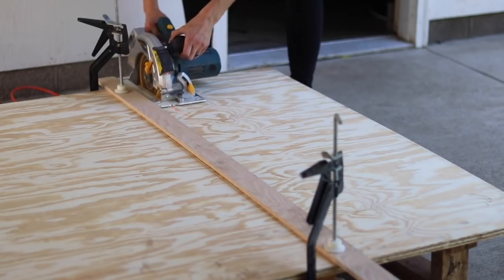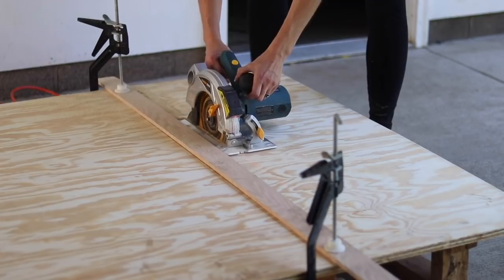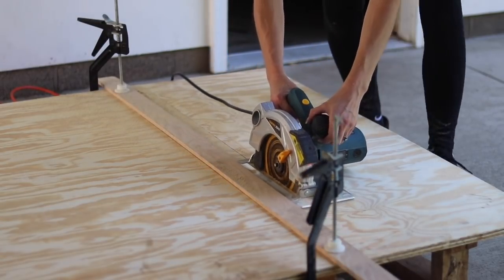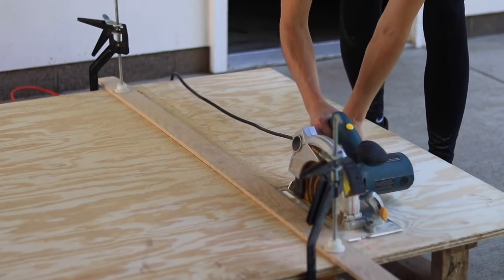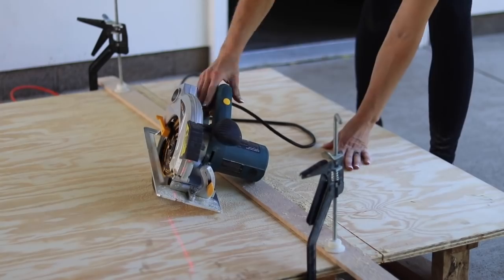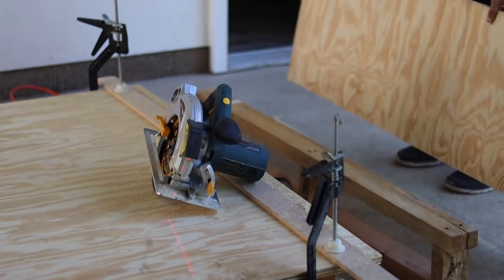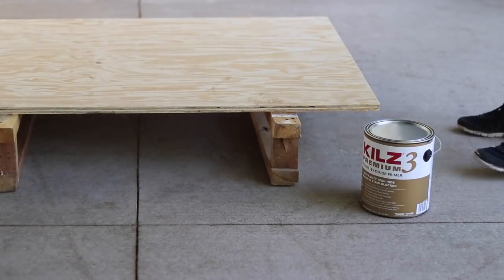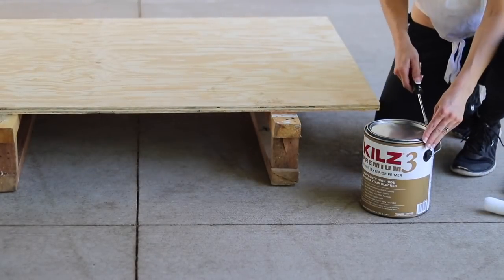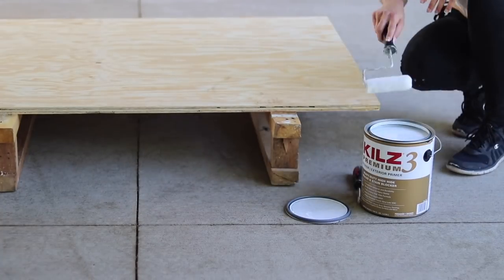You'll see here that I am just cutting a three-quarter inch sheet of plywood, because the three-quarter inch is about how thick the floorboards of the porch floor were. I'm going to cut this large piece of plywood to size, and I'm actually going to make the area where the patch is larger, and then put this piece of plywood decorated with a geometric design in place of the current patch.